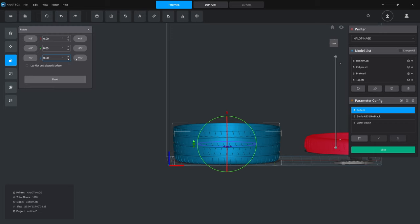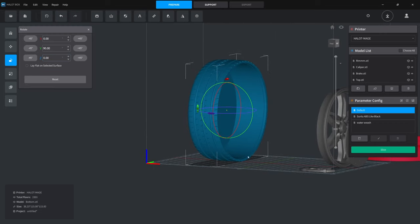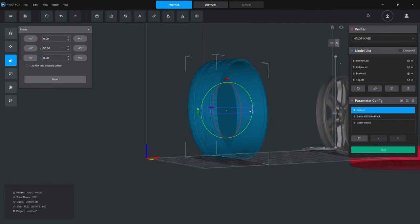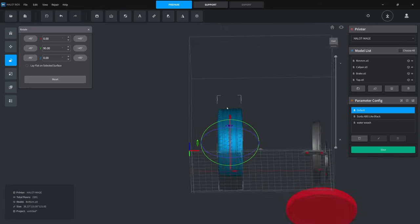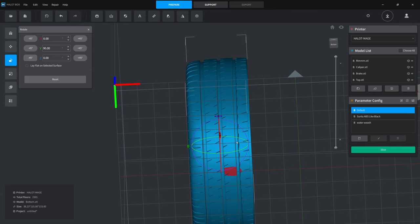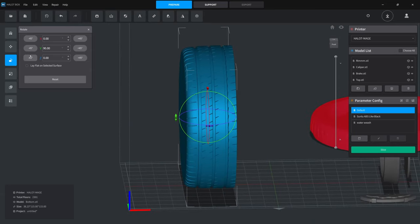I'm going to try and choose, not that one, a 90 degree angle, because at all points we're going to have an open face, so as not to create that suction, you know what I mean? And it's going to be actually kind of optimal for how much space you're using on your bed. But the trouble with this is you're going to have to put supports on this bottom, and this, I'd say, is a display edge. So there's another choice you have to make,